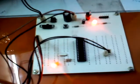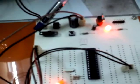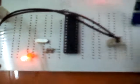The reset button is used to restart only the controller, independent of peripherals, and is supported by a 10 kilohm pull-up resistor to handle excess voltage. There is also a slide switch for on/off control — left side is off, right side is on. The crystal oscillator provides a frequency of 20 MHz to the controller.